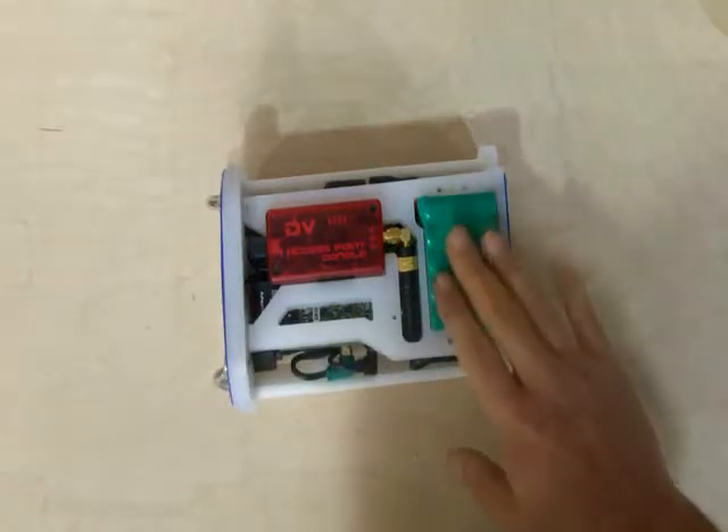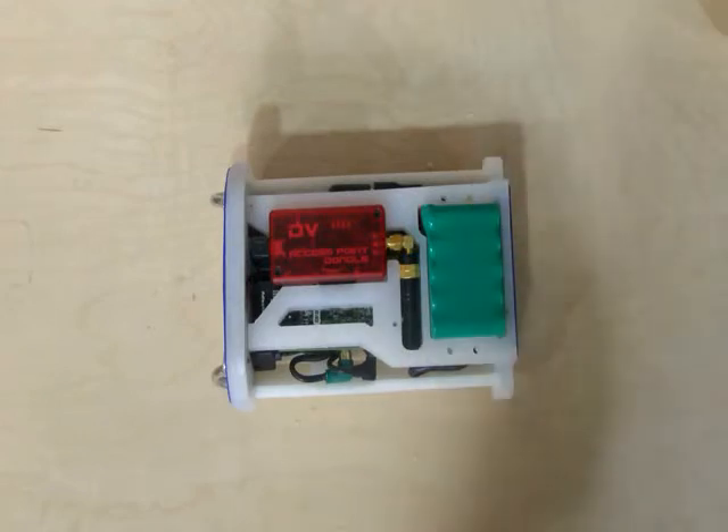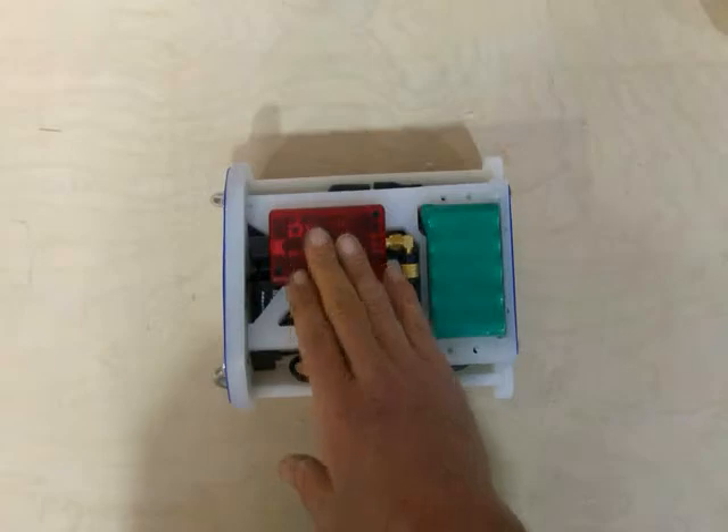This is a fairly common nickel metal hydride battery. We're definitely fans of nickel metal hydride. This particular one is composed of 10 AA batteries — it's a 2.2 amp hour battery, about 27 watt hours — very tough, with a pretty long life in terms of recharge cycles, somewhere in the 400 to 500 range. With initial tests, you're looking at basically running this system anywhere from 5 to 10 hours, depending on transmission versus reception. And that's if you don't charge it while you're running it, which you can do.